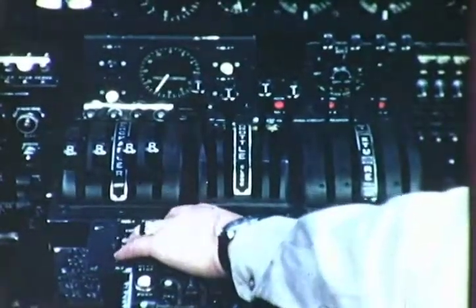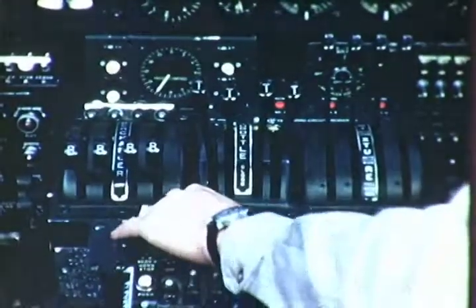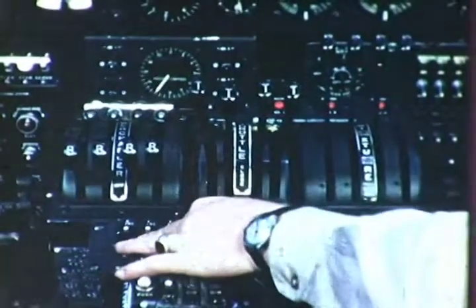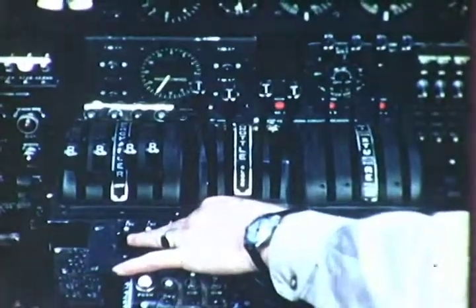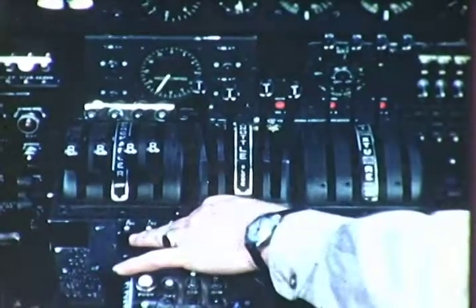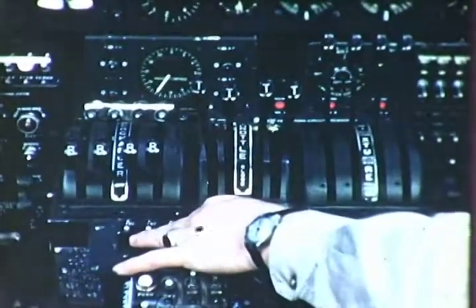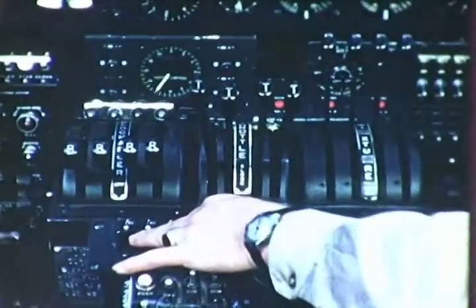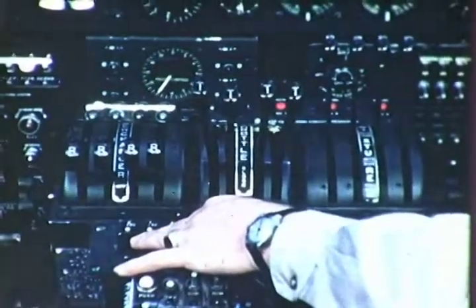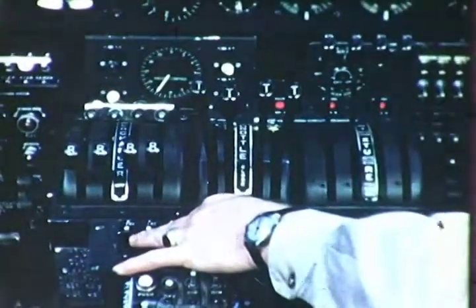High pitch is used in normal flight because the airplane has forward motion and demands a heavier grip. Now the switches are changed. The switch bar is thrown to INC for low pitch, high RPM, and held until the lights on the instrument panel flash on again. At high RPM, the engine develops rated power while the airplane is accelerating from a standstill. When the limit lights flash on again, the propellers are in full low pitch, and the switch is released.